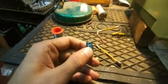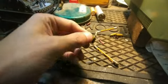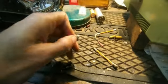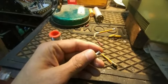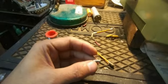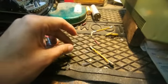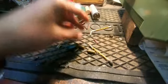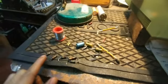The dielectric has already come out from inside this capacitor, so it's not workable anymore — it naturally had to be replaced. This one has a leg already gone, so I had to replace that as well. This capacitor of 0.01 microfarad connects the two anodes of the UCL82, but when I measured it, there was no capacitance, so I had to replace that too. Nothing new for these old capacitors — in old sets we need to replace these.